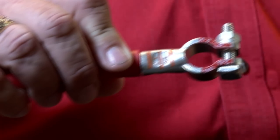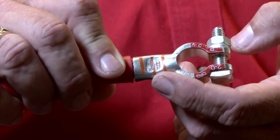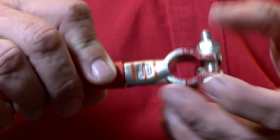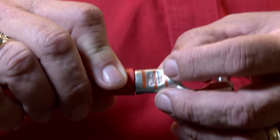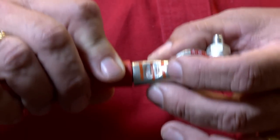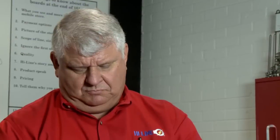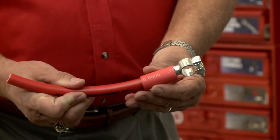The idea of making two crimps: one crimp would work, but two crimps creates a more solid mechanical bond, allowing more current to travel through. It makes it a little bit more solid and actually compresses that copper into almost a solid bar. Once you have the crimp made, you still have an open space between the terminal and the insulation, so we're going to apply shrink tube and seal that up to try to make the battery ends last longer.